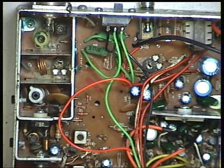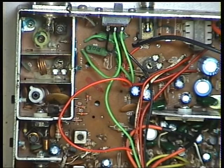That's the Fidelity 1000 now with the transmitter aligned. Later on in the week I will do a video on setting up the receiver, which will involve using a sweep generator to do the 455 kHz IF. That is the only way to do these, and that's what makes the big difference. I hope you've enjoyed looking at the Fidelity 1000 part 2.